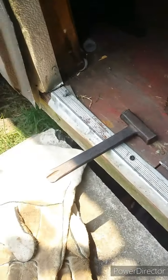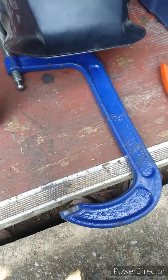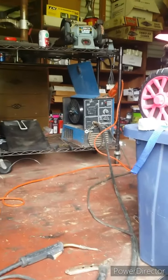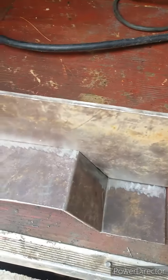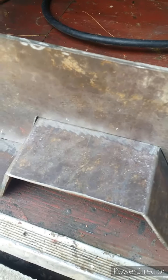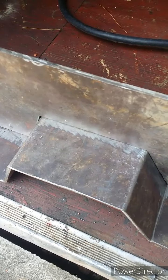Here are my tools: I've got a chip hammer, a wire brush, a clamp, my helmet, and some gloves. And the welder — a little crappy Miller Cricket, 20% duty cycle, 70 amps. I'm going to get in here, do all the top stuff first, and then squeeze that gap together with the clamp. Hopefully I'll be able to show you a final result in a few minutes. I am not the best welder in the world, but I can get her done.